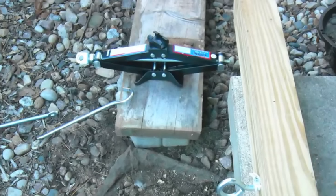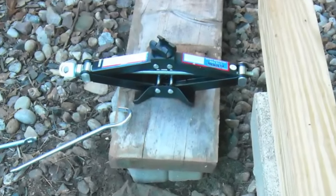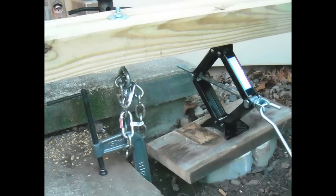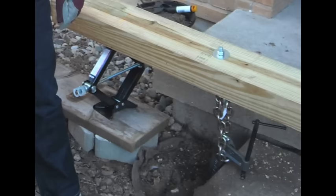These are standard car jacks that you probably already have at home. The jacks are in position resting on cement blocks and scrap 2x8 boards. The two jacks are raised slowly at the same rate simultaneously. I raised the slab 6 inches to prepare to slide in the foam.